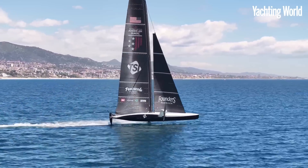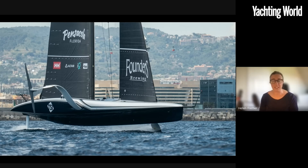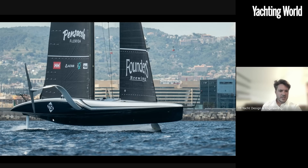There's been a lot of talk in our other conversations about how the boats are designed to handle the Barcelona chop and take off in waves. What does the much more slender, reduced barrel volume tell you about where they're going in that difficult transitional stage? Interestingly, I originally thought the bustle of American Magic was like a plate all along, but when you look in detail it's really quite rounded throughout. They have gone to the idea of reducing wetted surface area to take off faster, with perhaps slightly less tolerance to waves and trying to close the gap between hull and water, which ultimately impacts aerodynamics. It feels slightly conservative, but putting the levers where it matters — nobody wants to take off later than another team.